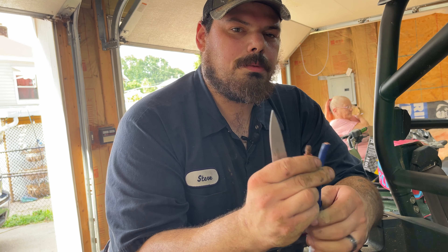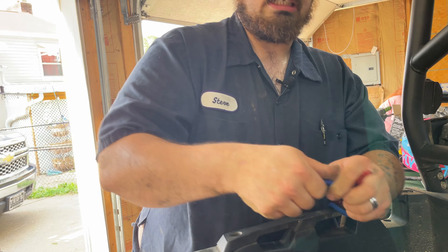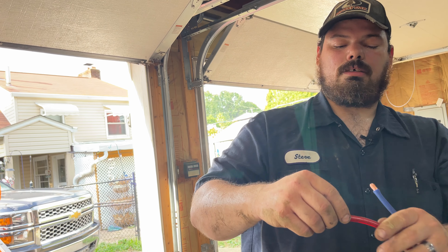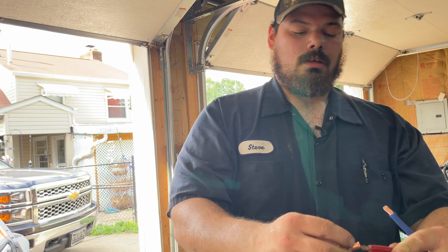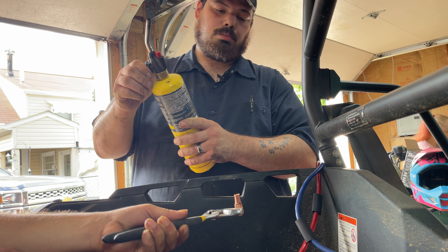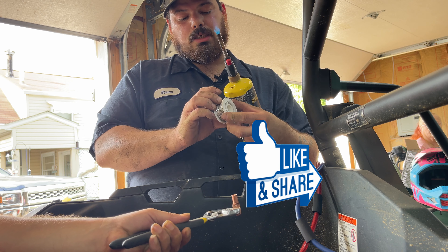You're going to want to strip your wires — I'm showing you how I do it, and it's easy. Once you get your wires stripped just like so, you're going to want to get your heat shrink put over them. How I cut my wire is I measure it just like so here, and you're going to want to put your end on there and make sure it fits, because you don't want to fight with it while it's hot. I have somebody hold those or put them in a vice, then get your torch. Always put good ends on your wires and always do it the right way — don't half-ass it because you'll be coming back to do it again.